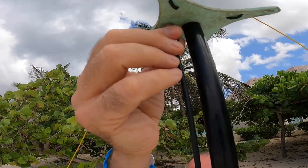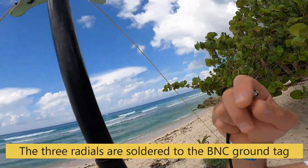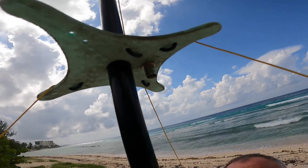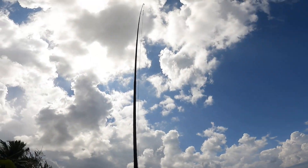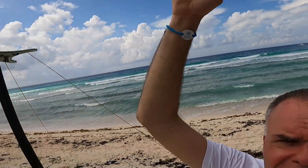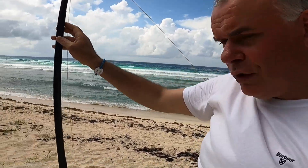On the bottom you've got a BNC connector that's just pushed through a hole and bolted on the other side, with the feeder wire soldered to it, and again that feeder is looped through and that gives it a bit of strength. Now this is on a 7 meter Spider Beams pole, but I don't use the whole pole for this. What I do is hook a little carabiner through the top of the pole and pull the chopping board section down until it jams on the pole. You might have to fiddle about and adjust the central hole in the chopping board to suit your pole, but when the chopping board jams, that's the actual vertical part of the antenna tight. I've only got 7 sections of this pole extended.